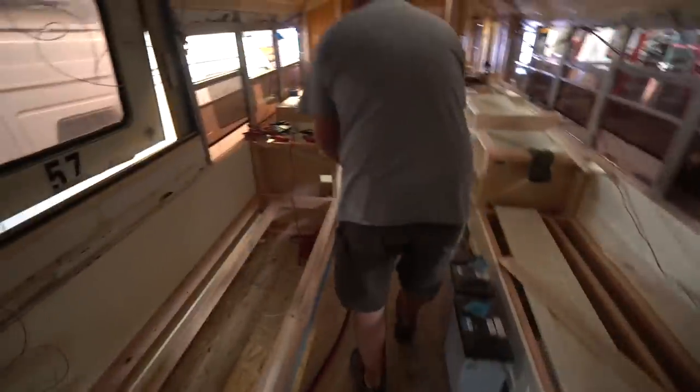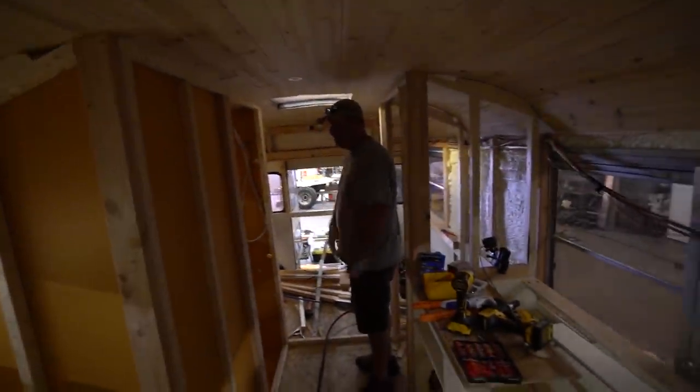Do you guys ever do a job and then realize after the fact that you kind of messed up or forgot something? Well, this morning we have the pleasure of running basically jumper cable wires through the back of the shower, and Reed fished through this PEX line, which is genius, and we're going to somehow tie it there, tape it, and pull the whole thing through so we don't have to take the shower apart. So thanks, dude.